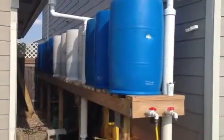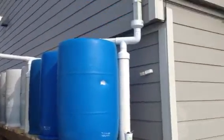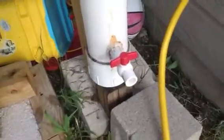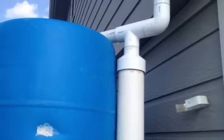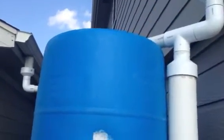Hello YouTubers, just wanted to show you my rain barrel system. I've got 12 barrels and three first flush rain diverters coming off the roof. First it goes into this funnel here and down the spout. I set up a little exhaust to drain off all the dirty water. When that fills up with all the first dirty water that comes off the roof — the bird poop and stuff like that — it will divert over and go into a hole on the top of the barrel.